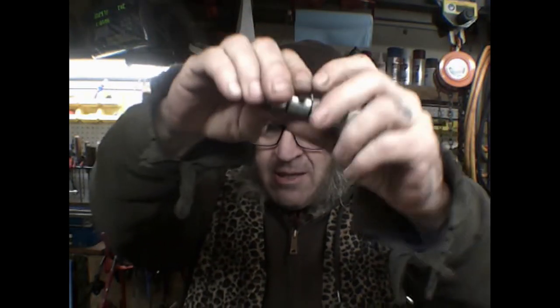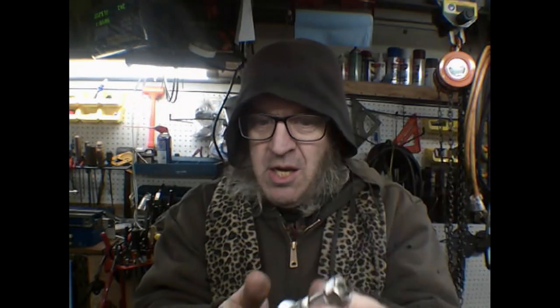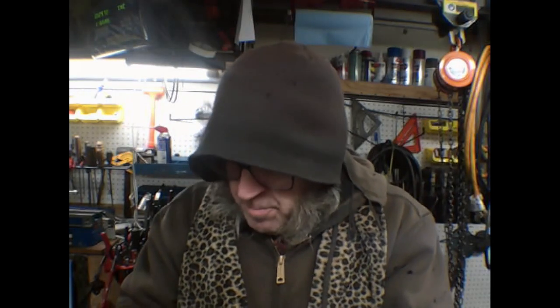I've got another regulator coming and I've got a foot pedal already, but this is where I started. There are some design changes coming, but this is a working machine. The handle I machined out of aluminum - pretty straightforward, just a handle. Nobody puts springs in these, but I put a little tiny spring in mine and noticed it quiets it down a little bit. It's a pretty loud machine otherwise.